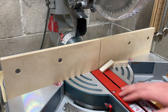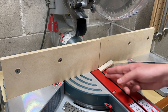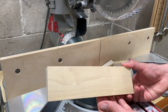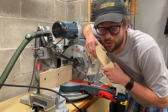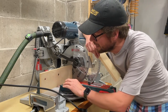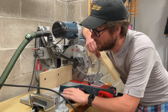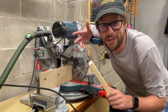I'd like to note that as far as the throat plate goes, it was adjustable and they actually encourage you to cut into it — so the blade has cut into this throat plate. When it does wear I believe it's three-eighths of an inch, so it shouldn't be too difficult to cut my own and insert it. But for now this solves 95% of my problems when it comes to getting nice clean cuts on the miter saw. Big thanks for watching. This is a very simple auxiliary fence — I didn't know if it was going to be an hour-long project, but it turned out to be about a 20-minute project from start to finish. If you don't have one on your saw, I put this off for so long and really wish I hadn't. If you have the materials and quarter-inch bolts on hand, regardless of whether you have the Bosch Glide or any other miter saw, I'd highly recommend doing this. You'll get much cleaner cuts and it'll improve the look and process of your project. Thanks for watching and see you in another video soon.